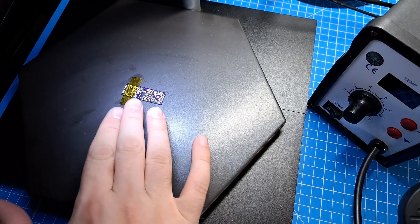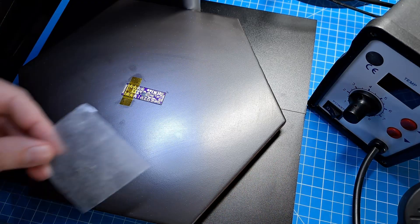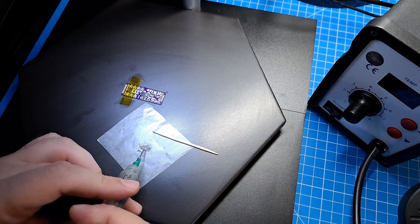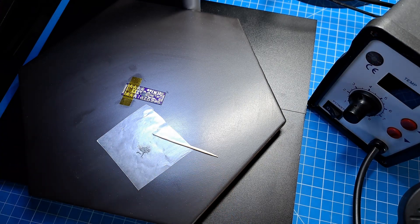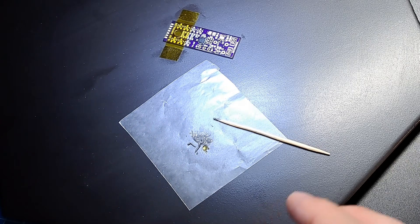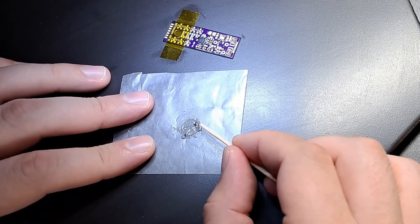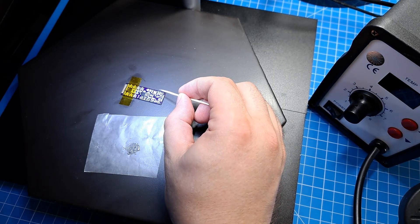In this video I want to finish assembling this board and I'm going to begin by coming back to my mix of solder paste and flux and get a good healthy amount down here and prep for the components that we now have to add. Just a little extra flux, not a lot. I just find diluting the solder paste with a little extra flux helps make it a little more easy to get it on the board. I'm just going to start dabbing solder paste on all these little pads here.